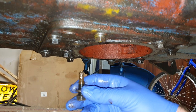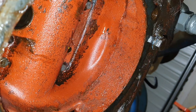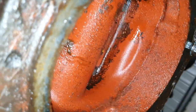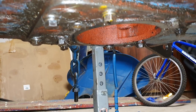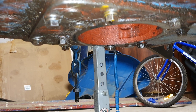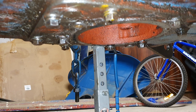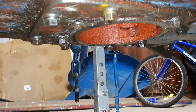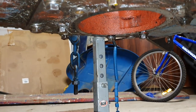If you're going to give the inside a bit of a clean out, best pull these out before you do so. Just a short video on one of the important components to maintain your hydraulic system in a Fordson Major. Just in case it's not clear — make sure you drain your hydraulic oil before you do this, because if you don't have a big enough capture point when you pull that plug off you're going to have a very messy shed floor. That's it from me — another short one, but again all the wonderful things about a Fordson Major tractor.